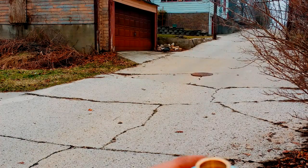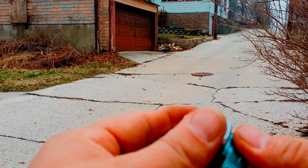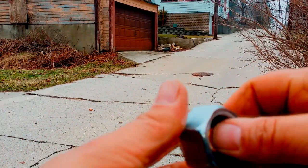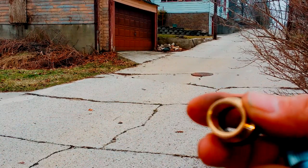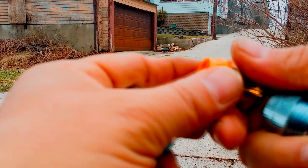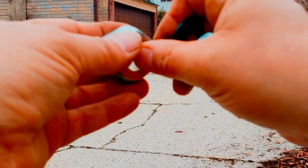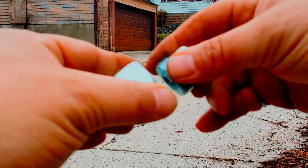This is the dielectric insulator here. It's a half-inch diameter dielectric, and basically what it does — this is used for water heaters — it separates copper from steel to prevent galvanic corrosion. There's a brass half-inch diameter fitting in the center. This gets a steel nut, an insulator that goes over the top of the brass fitting, like this, and a washer, and a back nut.